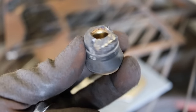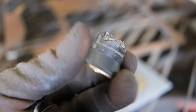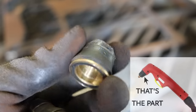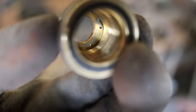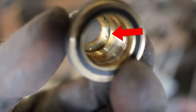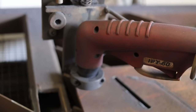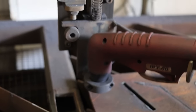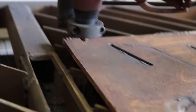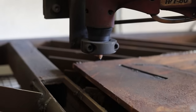Apparently, I can't fully trust my trusty CNC plasma table, because when I tried to cut more parts, the plasma was not properly working. After a while of looking for answers, it seems the cap is cracked. So the day you tackle your build list and start building your own CNC table, remember to mount the plasma gun on a detachable head with a sensor to shut down the machine in case of a crash. Otherwise, the gun cap will take a beating and it may crack — just like mine. After I changed the cap, I resumed parts production.